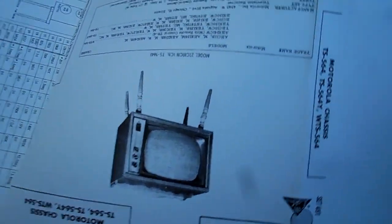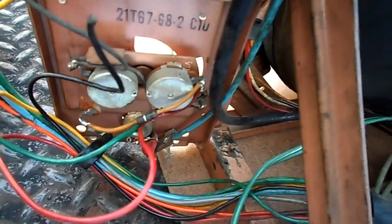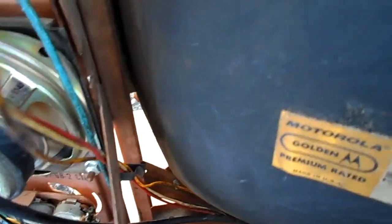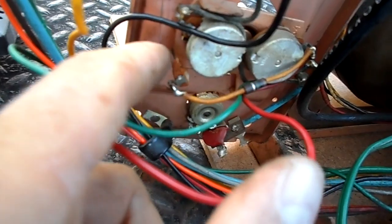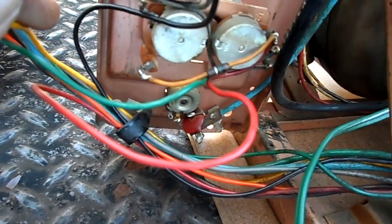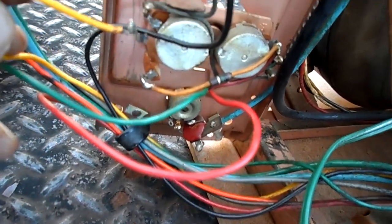That's what the set looks like. I noticed another side of damage here. The tuner was just hanging, but Motorola has made these service slots available to hang the tuner on the side like it is, so I put it in service position. I've noticed from it being handled that this is broken, and this wire is — now we have two wires broken. It's a good thing I found out where the one wire went before this wire broke off.